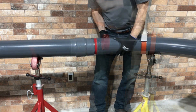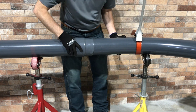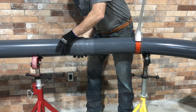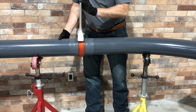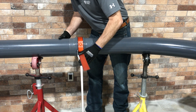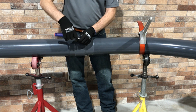With the coated coupling and the conduit properly aligned, thread the other end — the smaller OD of the coupling — onto the conduit or elbow. Tighten both ends as necessary with a Z-wrench or strap wrench, so as not to damage the outside PVC coating. Tighten the set screw to lock the internal swivel ring in place.